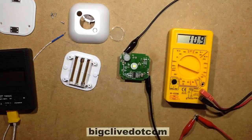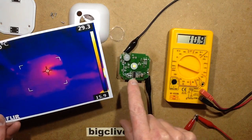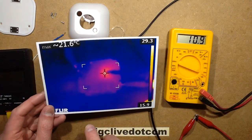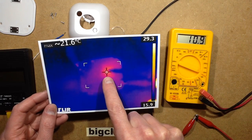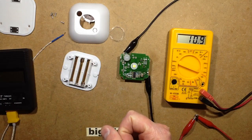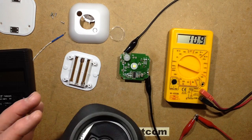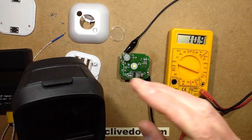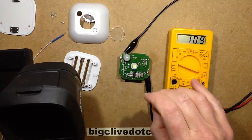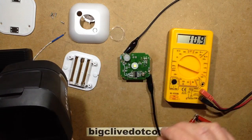It turned out there wasn't just a slight hint of warmth. If you consider that's 4.5 volts at about 10 milliamps, it's 45 milliwatts, and it produced a very vivid difference in intensity. Because I'm quite close with the thermal imaging camera, I can't use the overlay facility — it has a regular camera as well as thermal, and can overlay edge detection to make it clearer, but in this case the whole thing was just one colour, since the rest of the circuit board was low energy and that spot was just high energy.